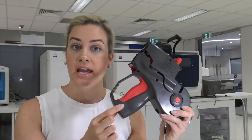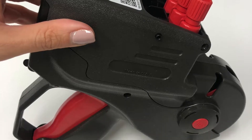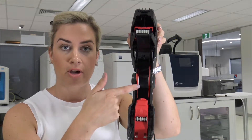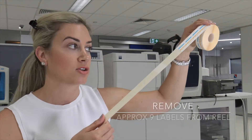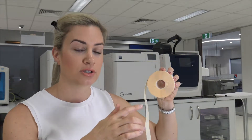I'm going to show you how to load your GKE label gun. On the very top of the gun there's a big red button. If you push the button it'll open the gun itself, and what we want to do is pop our labels into this middle part here. Before putting the labels in, remove around about nine labels from the actual sticker reel. This makes it easier to feed through the labelling gun so that we don't get any labels caught up on the internal of the machine.